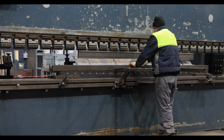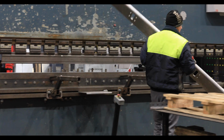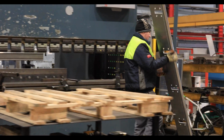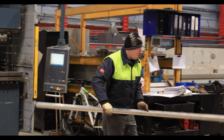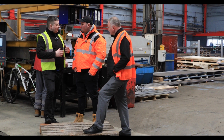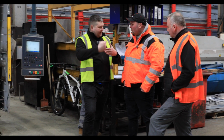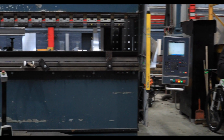So if you want to make a chassis rail or a big piece of flat steel that's 12 meters long, and we have an 11 meter half pipe body. Now, if you don't have such a big machine, you will need to use maybe a 6 meter plate and join it in the middle. So you will weld it. Yeah, it's a heat, it's another welding seam.